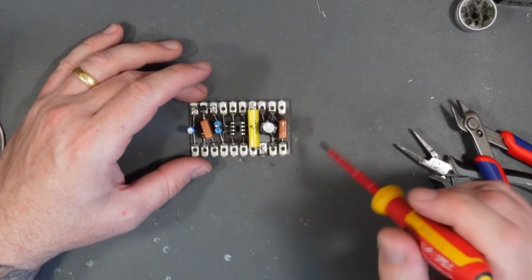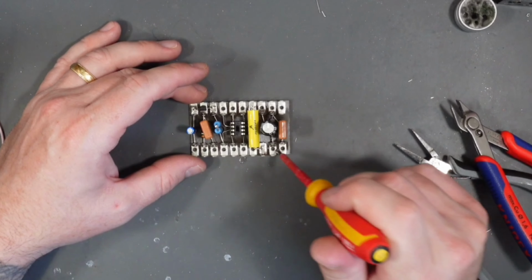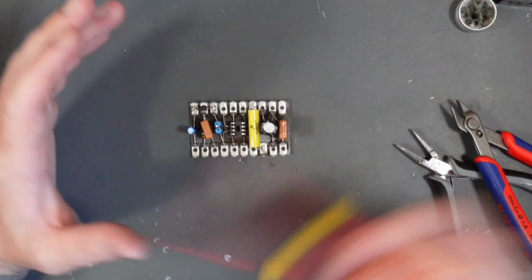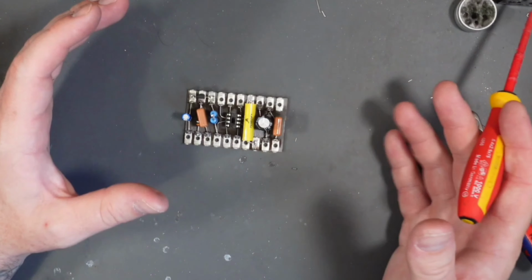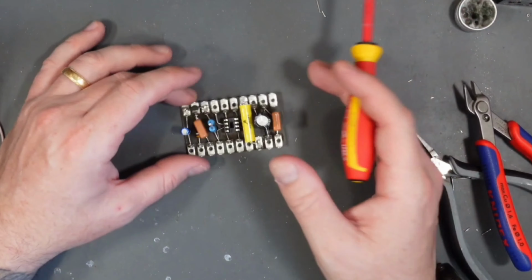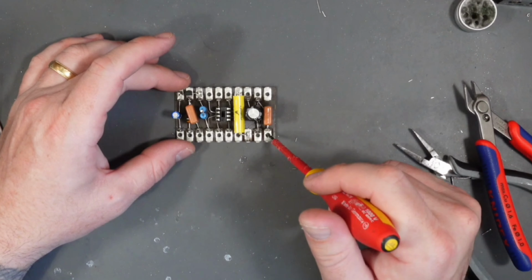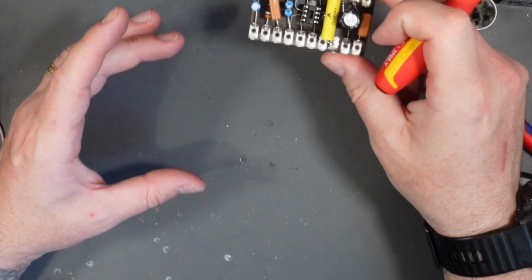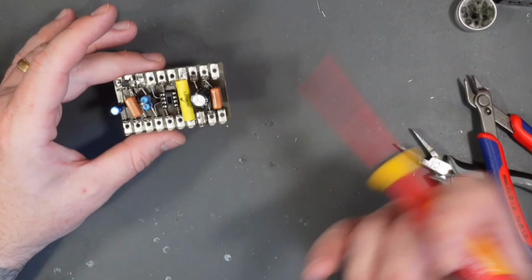And there is another link, I believe it's from here to here. Yep, from there to there is another link. I'm going to run that one on the top, just so then it doesn't get confused with all the other stuff I'm doing. You could run them all on the top, you could run them all underneath, it doesn't really matter. But I do advise that if there's plenty of the tags linked together, I would run it before you fit it into the cab, and before you start running all the other wires, so it doesn't get confusing.